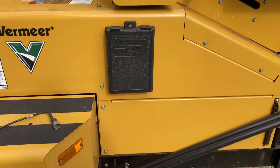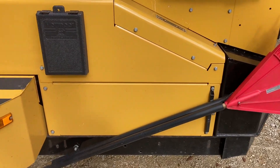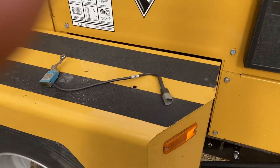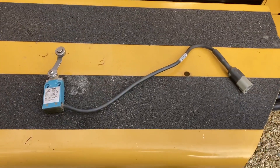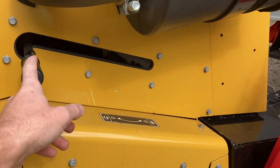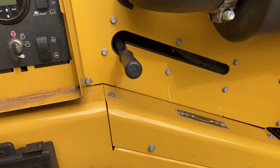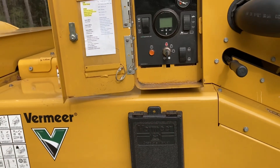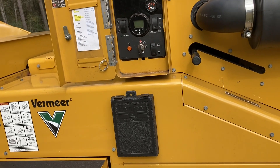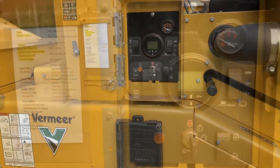Hey guys, we're looking at the BC 1500 today. We've been having an issue with our machine, we finally got it diagnosed and I wanted to share that with you guys. There's a limit switch on your clutch handle which is located here for your engagement — I'll show you in the engine bay in just a moment. That switch is located on the clutch handle, and what was happening during regular operations was the machine went idle down almost like it was in eco idle.